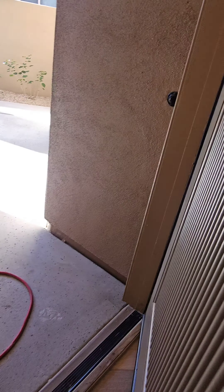This line is going to go back into the house, and the other one goes out. We just need to take these caps out — try not to get rocks down into the sewer line as much as possible. It's a good idea to have these clean-outs visible; sometimes they get buried too much. If they were up four or five or six inches farther it'd be better, but we can find them, open them up, and get in there — not a problem. Don't even need the wrench on that one.